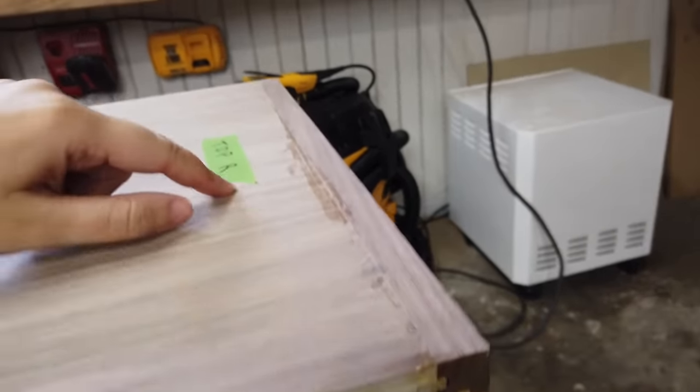Just a quick sand to see what this is all going to look like. I think this looks really awesome and I'm super happy with the results. Compared to the test piece with the thicker filler strip, the difference is really negligible. So if I had just used a filler piece the same thickness as the plywood without adding the inner chamfer in the corners, it would have turned out really cool. But when I see these two together, this one looks a little bit chunkier, and it's that small difference that I'm happy I went the extra mile and added the inner chamfer. But it's totally not necessary — this piece looks pretty cool too. Now I'm going to test out that quarter-inch round over on the other test piece.